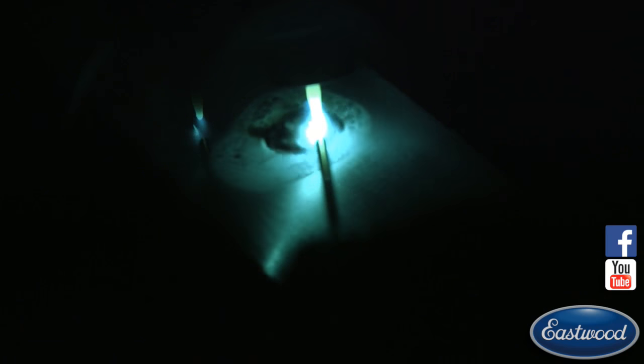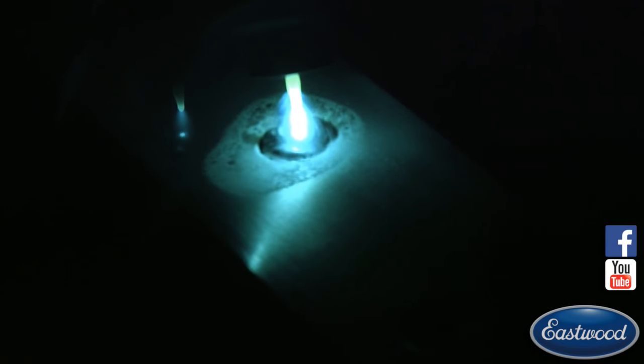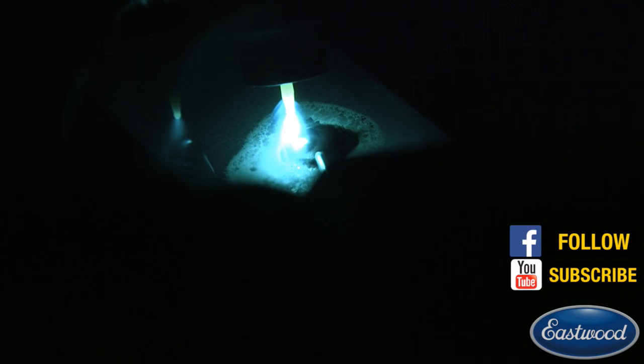All right, action. All right, so same thing. We're going to go over the whole area, try and get it cleaned up. This outer edge of the hole, remember, we haven't cleaned with the torch yet. So I'm just letting that alternating current dance around and clean for us. Clean, clean, clean. I go here in the center, clean, and I'm starting to add more amperage. Keeping my filler rod out of the center right now, but it's real close just in case I need it.